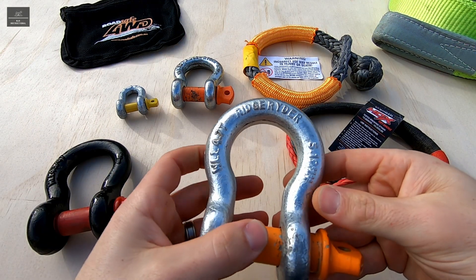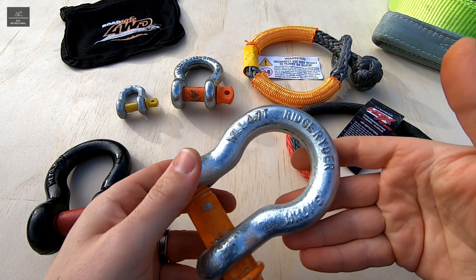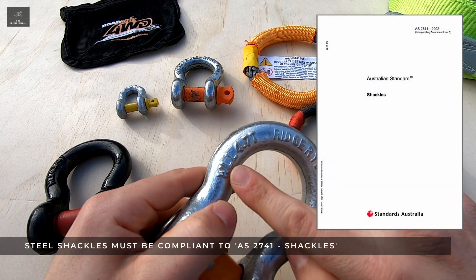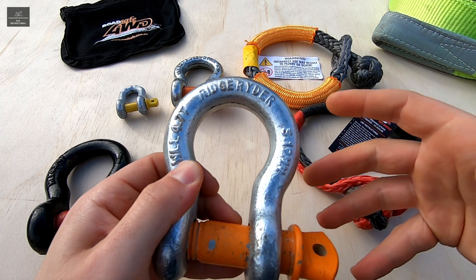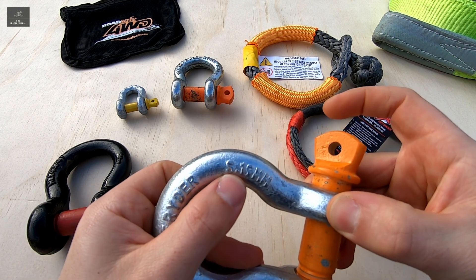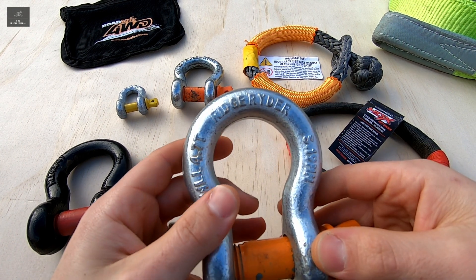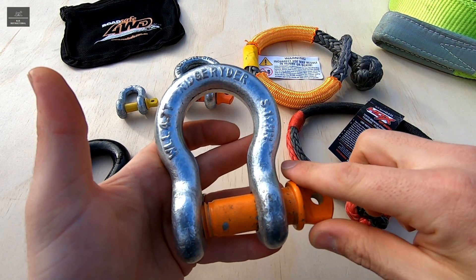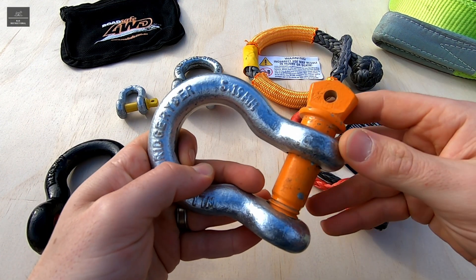Let's start with steel shackles. Steel shackles that are sold here in Australia and are used for lifting applications must be compliant to AS2741. For example, they must be marked with a working load limit value or WLL — the maximum allowable load that can be applied to the shackle — the grade of material, commonly either an M or an S, and the supplier or manufacturer ID so it can be cross-referenced to a test certificate. Other requirements include the shackle body forging specifications, the dimensional specifications and ratios of material elements.